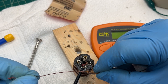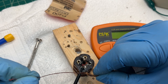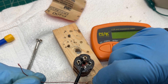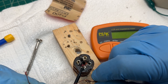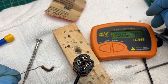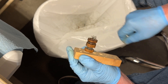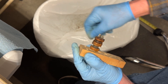The rest of the coil, as far as I can tell, was wound in plain magnet wire — a really high AWG — to get somewhere around 18.9 millihenries, based on the other coil that's not open, and about 136 ohms of DC resistance. You can see we're still open. I'm still unwinding the coil by hand and have not uncovered a break at this point in time, so I'll come back and provide an update.